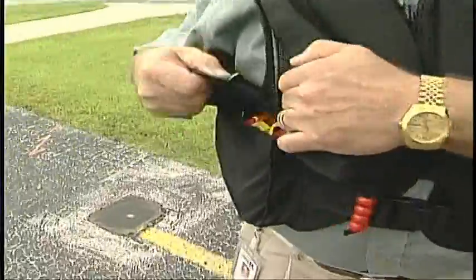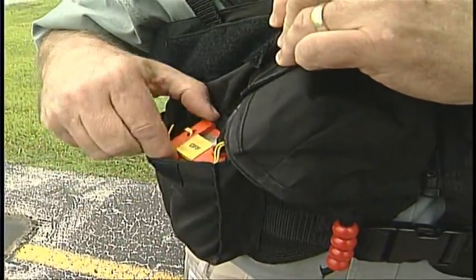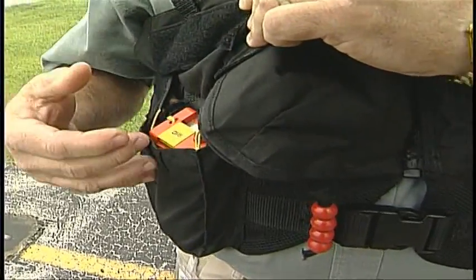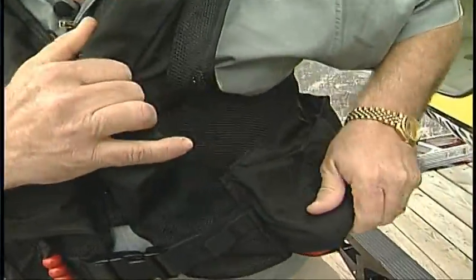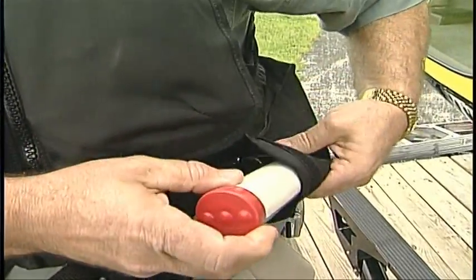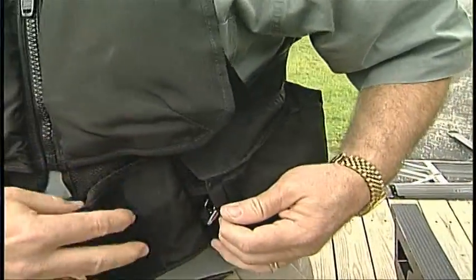The pilot's vest is different than the passenger's vest in that there are certain emergency pieces of equipment in here. On the pilot's right side is an EPIRB. If he is incapacitated, you can pull this out, just flip this little yellow switch up, and it'll turn it on. It acts as a homing beacon for rescue forces. In the other pouches, there are assorted different signaling devices. We have flares, we have dye markers, there's a mirror in here for signaling people.